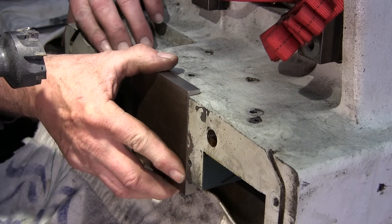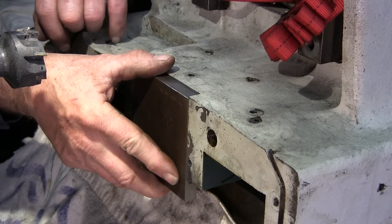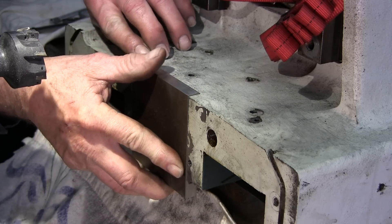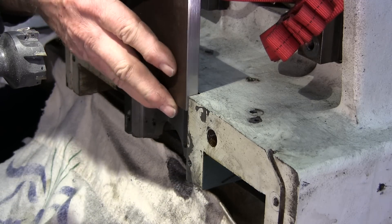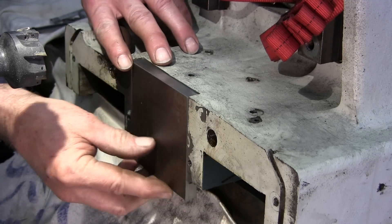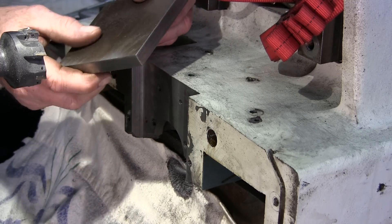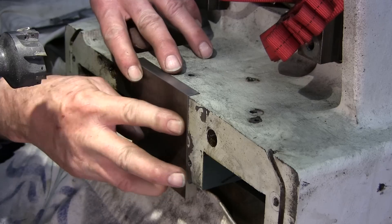I got this piece fit in here. This was the first side I did and I went to four inch because it measured with calipers, but it shows that it was a little bit loose and I wanted something tighter. I massaged this so it just goes in there, won't rock, and it doesn't matter which way you go. So now I'm going to take a scotch brite pad and clean up these two faces. It's cold roll but it's got an atmosphere on it from sitting around and I want to be able to lay it out. Having a nice fit piece in here feels good.